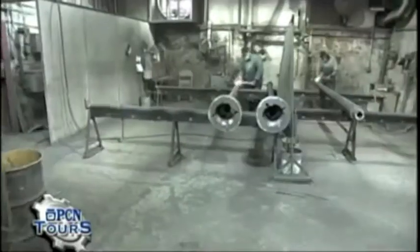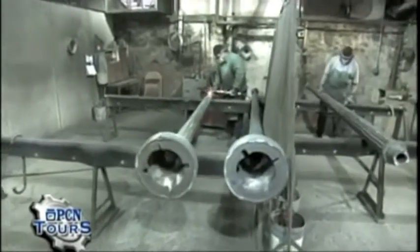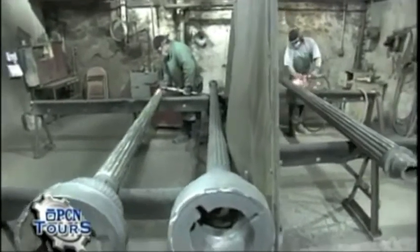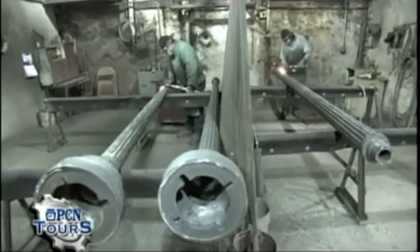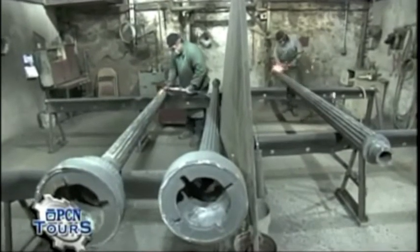What you're looking at here is some more of the hard finishing — getting off some of the chaplets, cleaning off any of the debris that's been cast into the pole. This is a standard process and the poles and shafts are starting to come into the finished product.